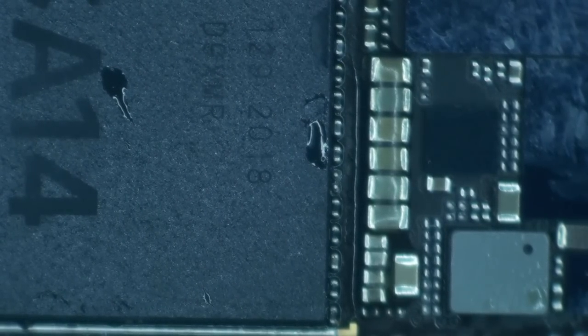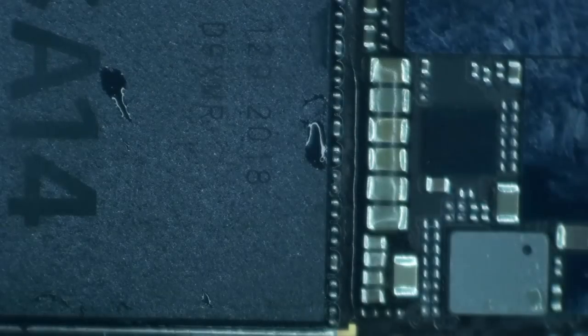And then while the board is still hot, I'm going to start carving out the CPU. And this is actually the only foreign version that I have here. So I'm going to be excruciatingly careful not to disrupt the components around here. Normally on the donor board, I can fly through this because I don't really care what happens to those components. There goes a cap. You're gone. I don't really care what happens to those components, but on this one here, we might need to go around measuring values, especially if it don't work.